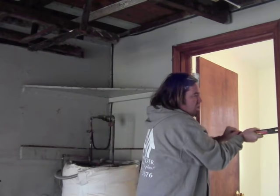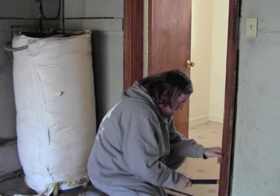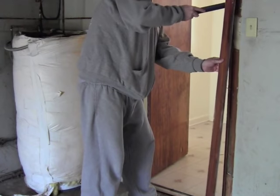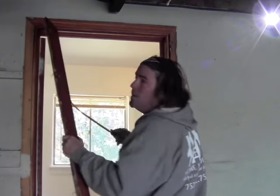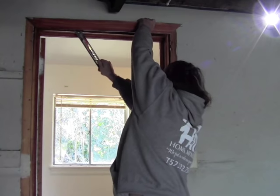The first thing we're going to want to do is remove the door casing from both sides so we can get our door jamb out of there. Mine is stained so it's not going to be caulked, but if yours is painted you might want to cut the caulk line right there at the wall so we can free that up without damaging it. I want to reuse my casing so I'm going to be gentle taking it off — got my super bar here, just gently pry away. This other side of the door is painted casing so we're going to score right there at the wall so we're not going to damage the wall or the casing getting it off.